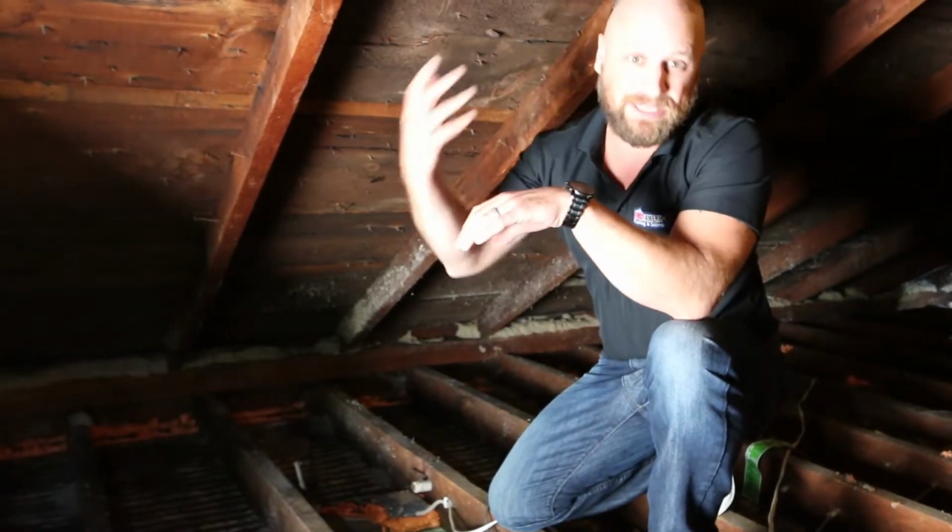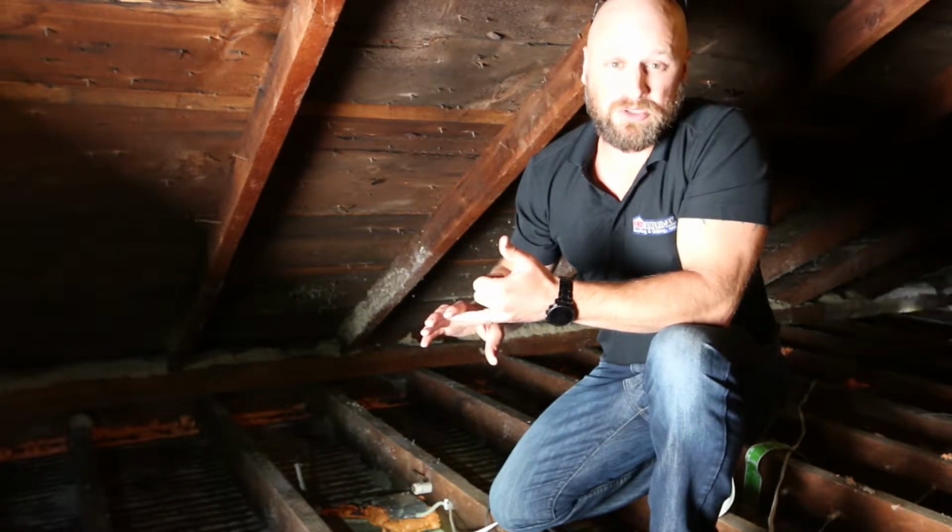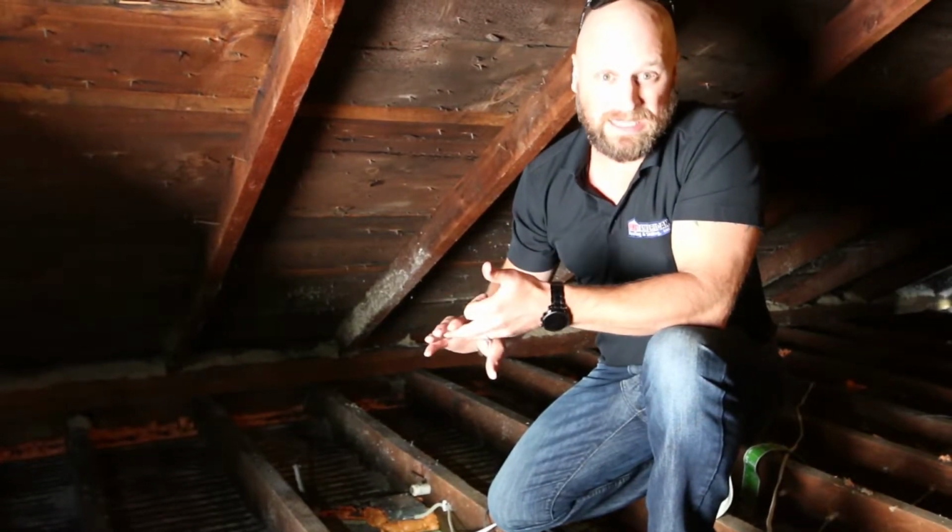If that's not sealed, or air sealed as we call it, heat and moisture from inside your home goes through your outlet, up the wall, and into your attic. So you're losing heat, and then you can have condensation and moisture issues. So it's vital when you're insulating, you're re-insulating an attic or your home, that you air seal. So that's what we're doing today.